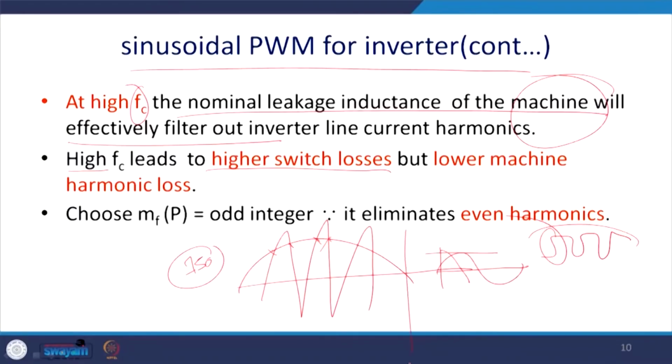So you can see how it has been calculated. There will be a huge number of turn ons and turn offs, because it is not about the switching frequency, but how many cuts there are. Here you can see that this carrier frequency is 3 times more. So, it is 3f and this is f, so you have 6. If it is 200, then it will be 400 times turn on and 400 times turn off. So, there will be huge losses.